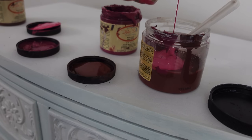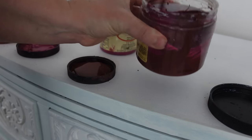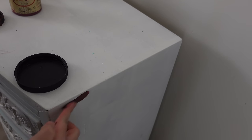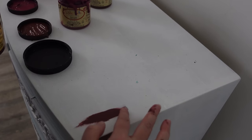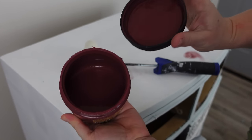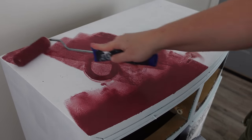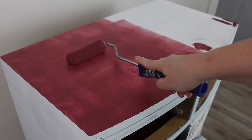I'm doing a custom color using a mix of Muscadine Wine, Peony, and Plum Crazy by Dixie Belle's chalk mineral paint line. My ratio is two parts Muscadine Wine, one part Plum Crazy, and about half a part of Peony. I ended up adding a little more Muscadine Wine because it was too pink — I wanted it to look more like a color I saw on Pinterest called Marsala. I used my finger to test it on the piece, and once I liked it, I mixed it for a really long time. I use my roller and water mister to apply chalk mineral paint on flat surfaces — it reduces brush strokes and gives a really smooth finish.